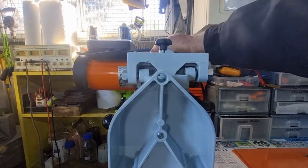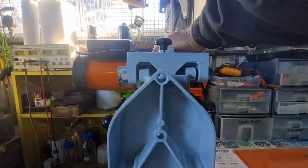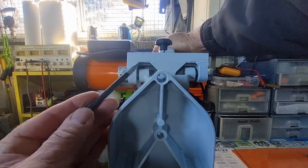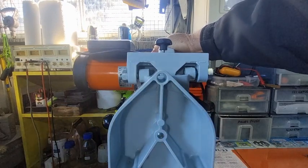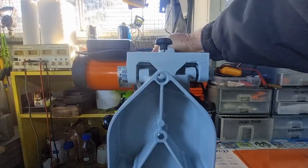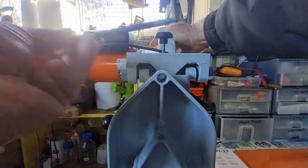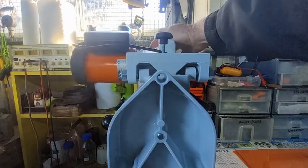If we look at the back of the grinder there is an offset of about three degrees. You can see a larger gap here and a smaller gap there. So the axis — if you look between the hinge of the fixed base and the moving head — it is not parallel; it's offset by three degrees.